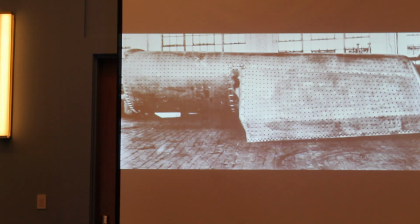Now we're going to talk about the tubes, safe ending, that Tim had originally asked me to talk about. Every 4 years under ICC rules, until 1998 when the rule was amended, you were required to take your boiler tubes out, 4 years maximum for a set of boiler tubes in your locomotive. You could get extensions by the ICC inspector if you brought him in. I want to continue to run this.